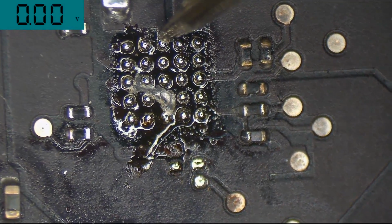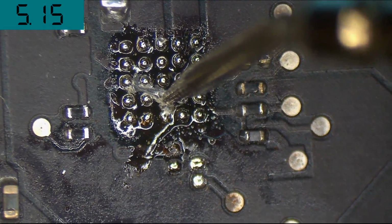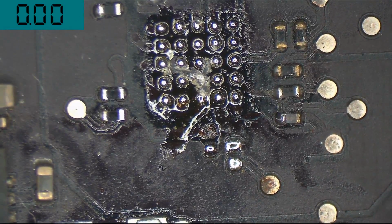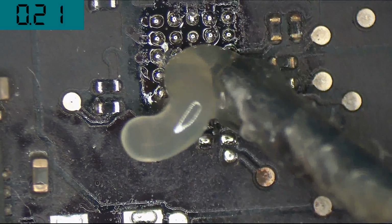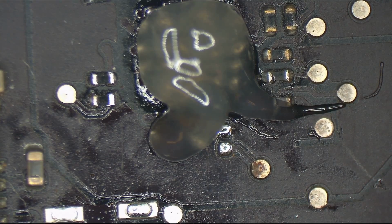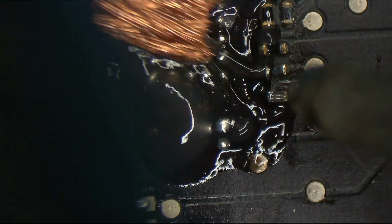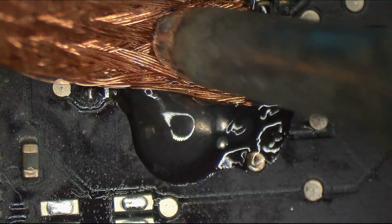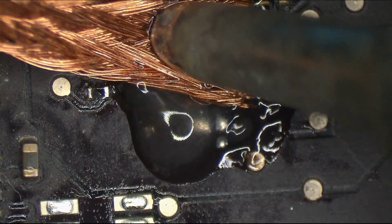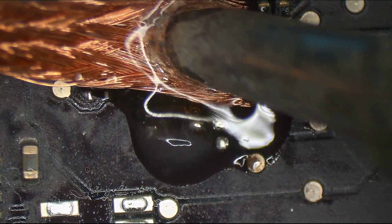All right, so the 5... wait a second. Yeah, meter. 5 volts where 5 volts is supposed to be, but no 3 volts where 3 volts is supposed to be. So let's first see if there could be dirt under the solder. Let's dig a little. Maybe, I wouldn't doubt it. I was undesirably thinking it might be a smart decision to take solder paste and custom make my own balls that were very uneven and inaccurate. I figured that would be the best method. I'm not quite convinced that 3.3 volts hops from that capacitor pad to underneath the IC.